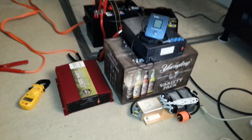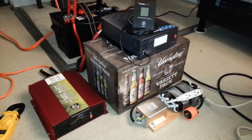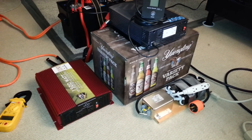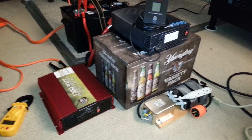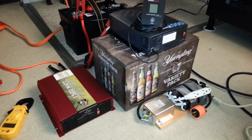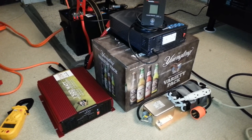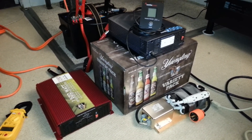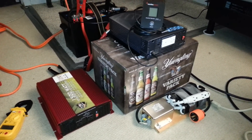I had a little time today to do another experiment that's been intriguing me, and it pertains to power factor on these two inverters — more specifically power factor correction and how they deal with that. With power inverters, you usually have two ratings: a wattage rating and a voltage amp rating. Power inverters care more about voltage amps. Wattage refers to real power from the utility, and voltage amps is the voltage applied to the load times the amps going into the equipment. The difference between watts and voltage amps is called the power factor.